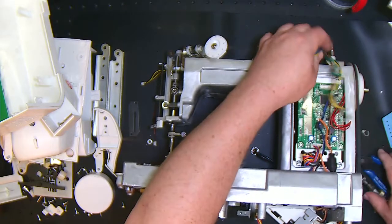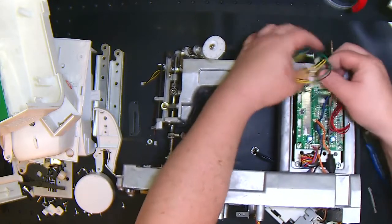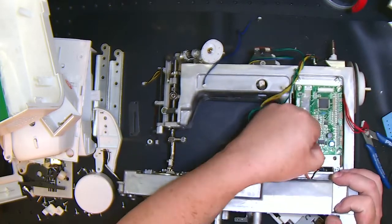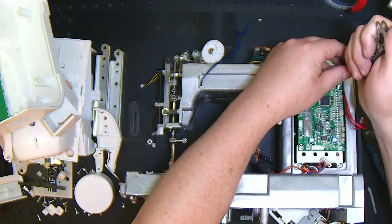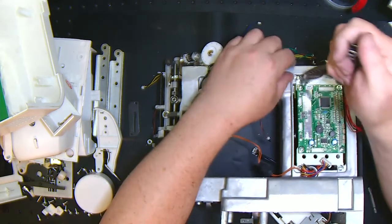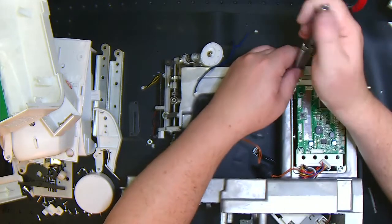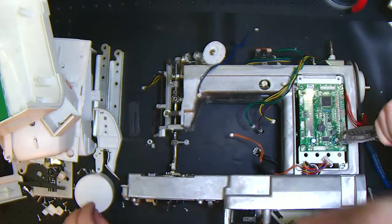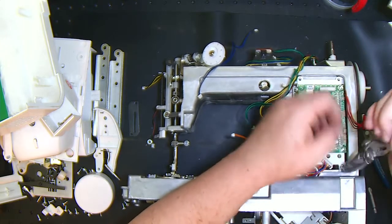connectors are expensive. So anytime that you can use a 4 position instead of two 2s, or just have things soldered right into the board, you're usually going to save money. Not always, just usually. So let's go ahead and remove these. It's actually quite a few screws holding this thing in. We'll see what's on the back side of this, but looks like there's a carrier board and then a PCB attached to maybe the carrier board. We'll see.